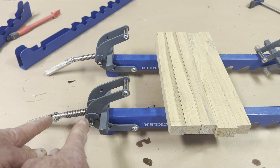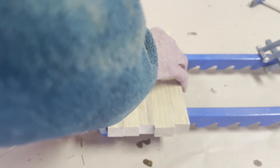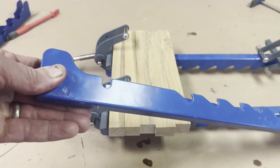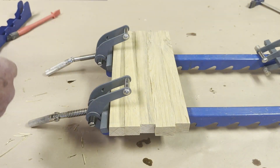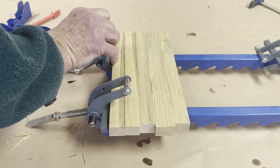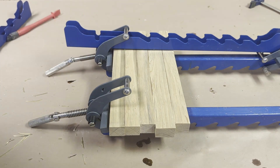After you've gotten them all glued up, you're going to insert that top rail. I don't insert it all the way at first — I only insert it until just before the vertical notch on the thread side and just before it goes into the mechanism on the tail side. I have to make sure they're oriented properly so that when I'm going to clamp them, that vertical notch is going to end up in the thread clamping mechanism. So there I've just put it in partway.